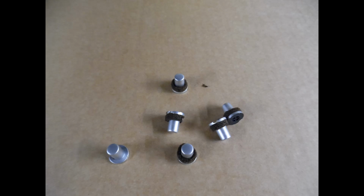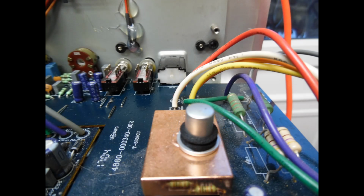What happens over time is that these washers disintegrate. If you remove the buttons, even if you just touch them with your fingers or a bit of rag, it almost dissolves into a thick oil-type substance and completely breaks down. So what you have to do here is replace them, and what I do is fit neoprene washers, and I'll show the example of that here in the video.